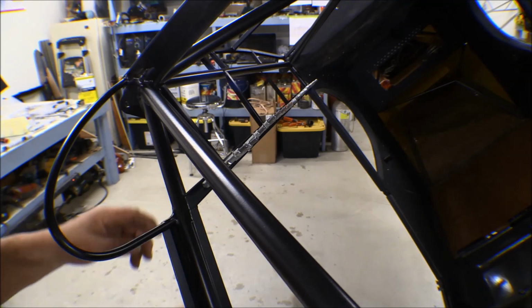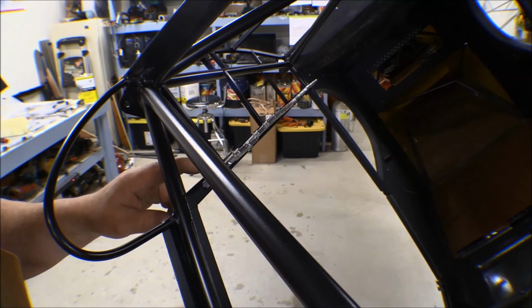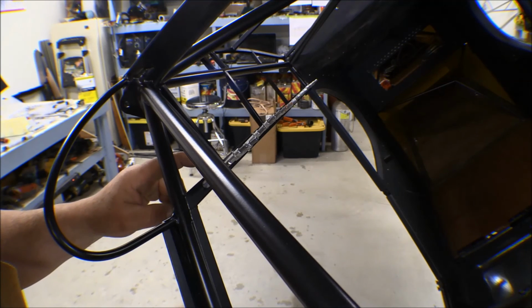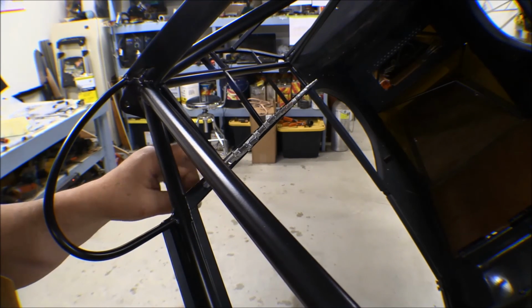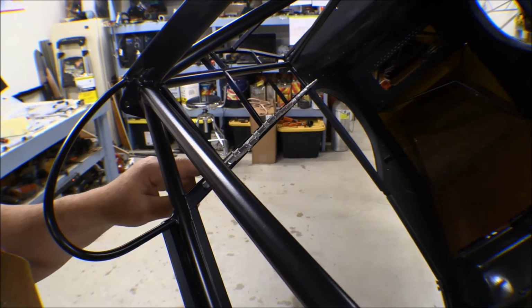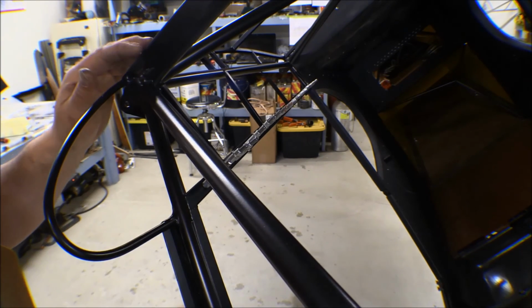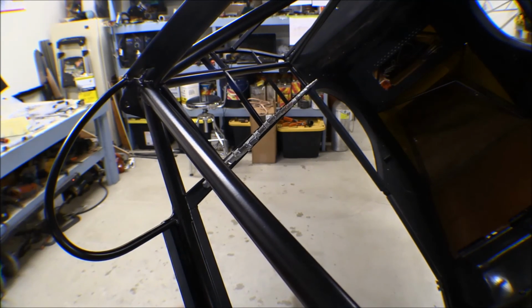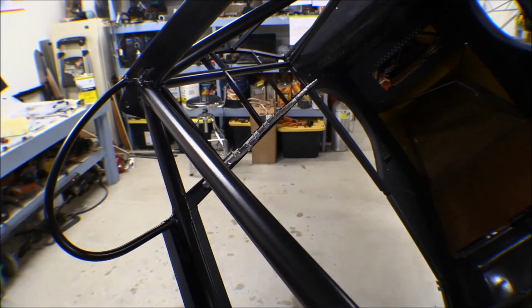And even then it's going to be kind of a chore, because we've got to have the clecos on the outside here. These are short nut plates, and so the rivets are right next to the clecos, and there's not much room to get in there on them. I got enough room behind it to get a bucking bar in there pretty good, easier than what I did with the top bar here, but it's going to be a challenge getting the mushroom head in there on these rivet heads.